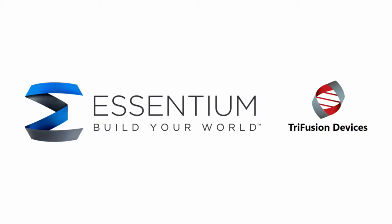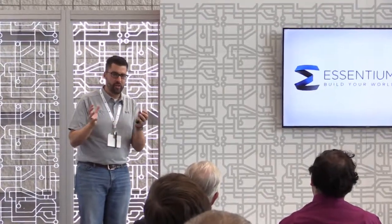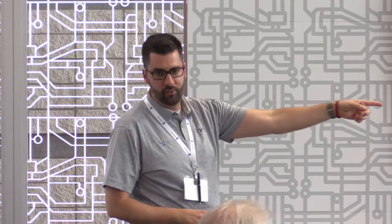Could you elaborate a little more on your carbon nanotube wrapping of the filament? We take a carbon nanotube polymer nanocomposite mixture and have an in-process flow where we fabricate the multi-layer filament. The filament is manufactured to the same quality specs as monofilament today from a diameter and ovality standpoint. We've printed thousands of hours — we don't have nozzle jams and we don't have any other issues from nanotubes. The outer layers are sufficiently thin so as to flow really well in the printer, which keeps costs down and cycle time up. The materials are already processed before you print. That spool on the table is multi-layer filament, ready to go right into the printer. Any open platform printer can print with our materials. You can get the electrical property improvements with any printer; for mechanical properties, you need the welding.